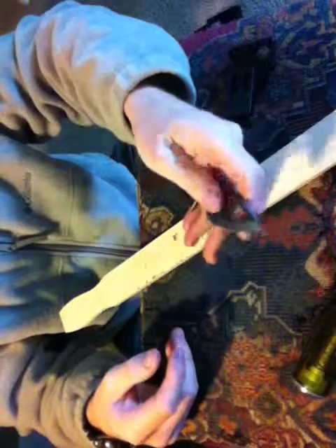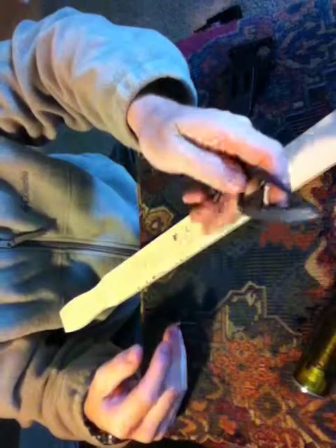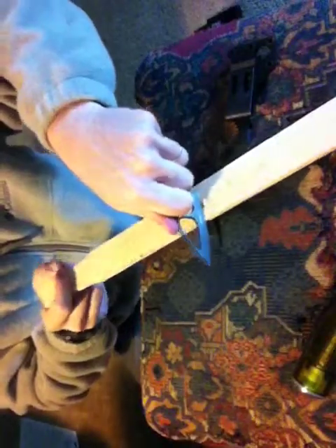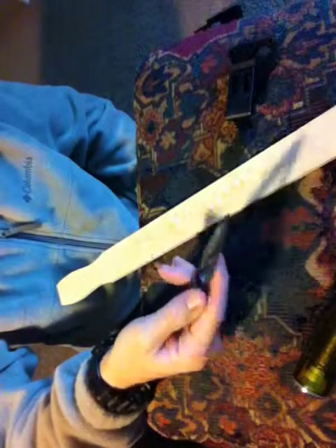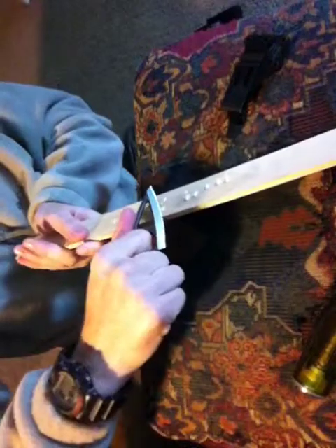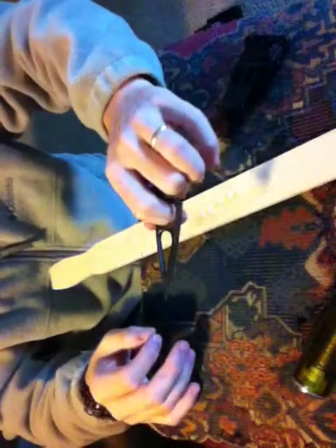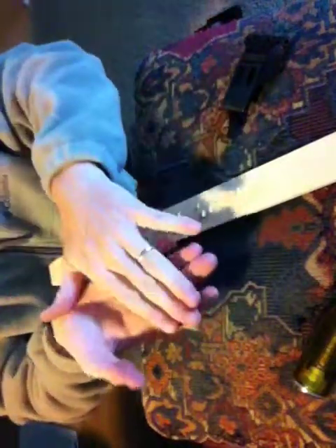Call that the pretty side — the side the knife makers are selling you. When you pick it up, you can't really see the grind on this blade; you just see a flat portion. The more attractive side, the side that the grind's on, is the left-handed side. So if a left-handed person is buying this, they see the grind and think it looks good. But this side without the grind — side B — doesn't look as attractive when buying, yet it works better for a right-handed person. You don't find many chisel ground knives with the grind on the right-hand side of the blade; most are on the left.